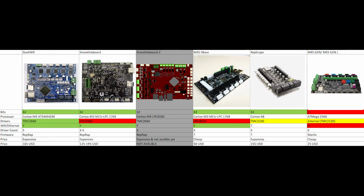And I don't think that will be an issue when I switch to 32-bit, since it's much more powerful than a simple 8-bit processor. That's the biggest reason that I wanted to upgrade to 32 bits, and I decided to upgrade to 32 bits straight away and just skip buying the exact same board and wasting another $20 to $30 depending on which store I buy it from.